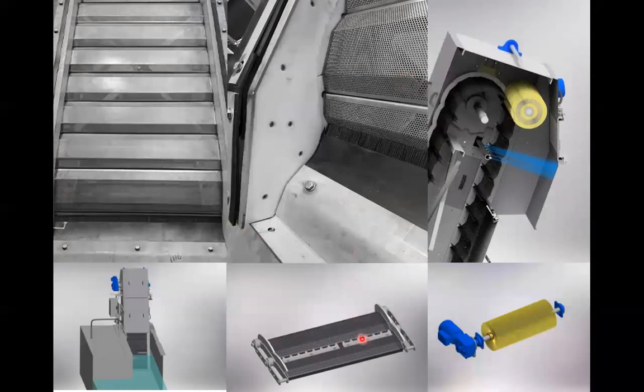These are debris removal teeth that lift screenings, or they lift long rags, or any kind of debris that will hook onto those. It'll lift that and carry it up the face of the screen. These are only on occasional panels. We don't want them on every panel because those have a wear effect on the brush assembly. But in order for them to be able to travel around the bottom and come up again, they have to travel through this brush here, and that prevents any screenings from being able to pass through. So it's quite a clever system to ensure that nothing can get through the screen and downstream.